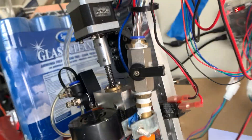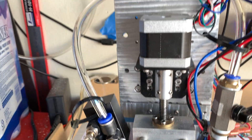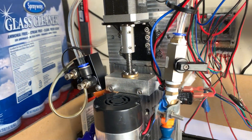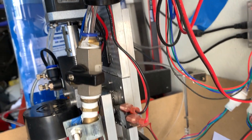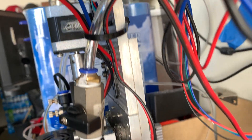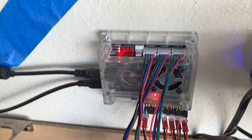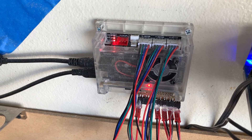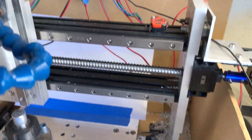The back plate has an extension because the machine can't handle parts that are too long — I think it can only do about eight by nine inches. So I added an extension on the back with a plate holding it together just to have more clearance. I'm still using the original controller, but it's mounted on the wall because vibration is not good for it and it keeps loosening the USB connection, which means the machine will stop in the middle of a part and break the tool.